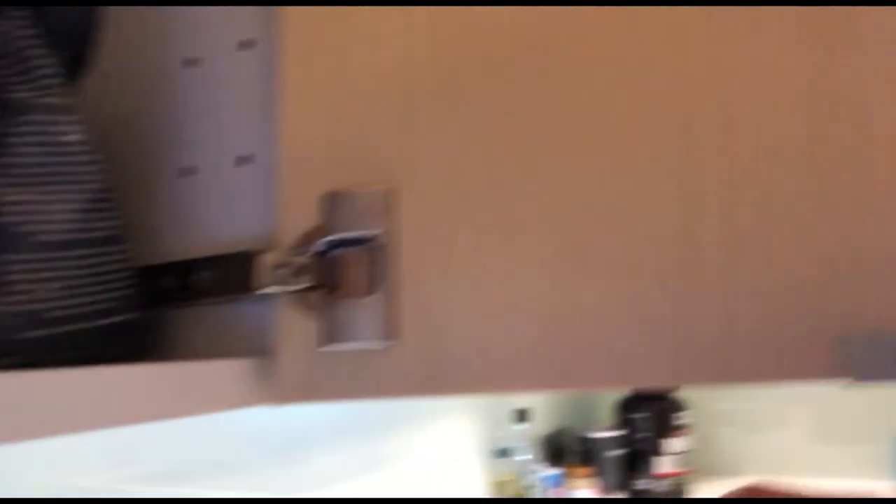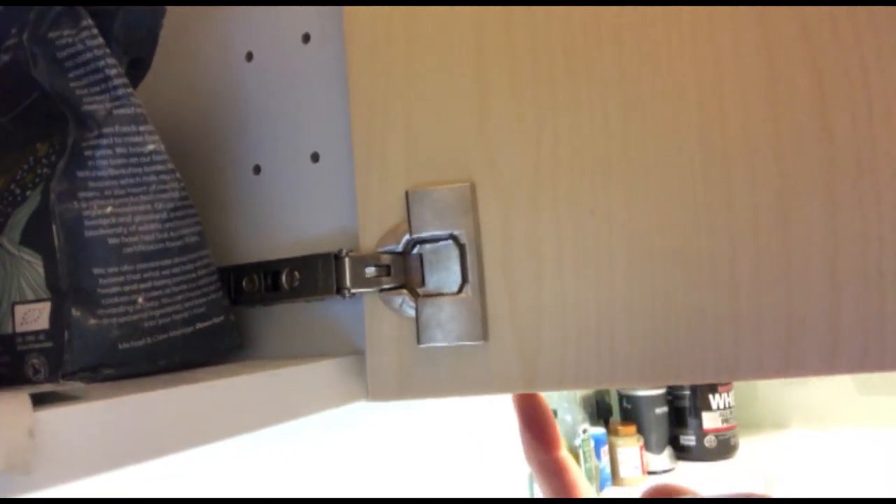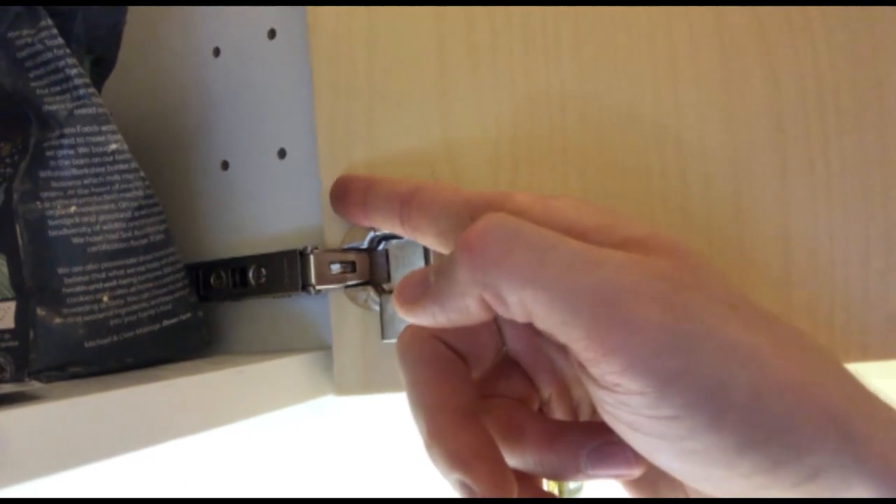So that's the sizing done - it's three millimeters off the width and height for all the doors based on the carcass dimensions. Now for the hinges themselves - they are a certain distance away from the bottom of the door and from the edge. I found those measurements online and then validated them using a vernier gauge to get more accurate measurements.